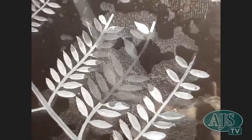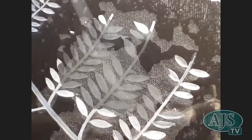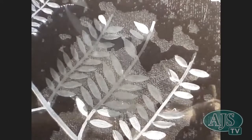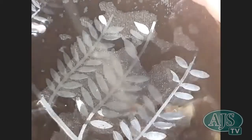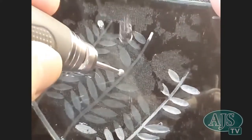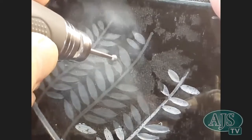This is actually a prototype for an award, a medal, which had a jacaranda profile on it. And I just want to sort of maybe show quickly how we can cut deeply. I'll do an extra leaf or so. And going back again to a ball burr, these are just built up. I'm going to build up a leaf here, a leaf in the middle. So I'll just start off with my simple cut and start cutting in, bringing the shape together.